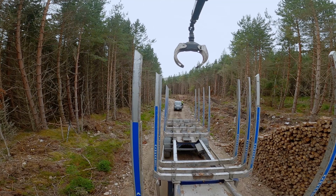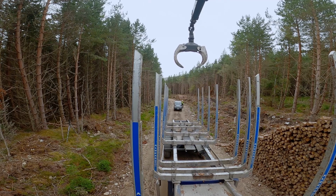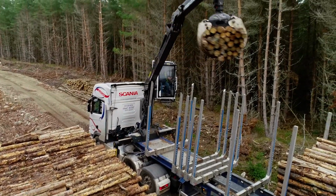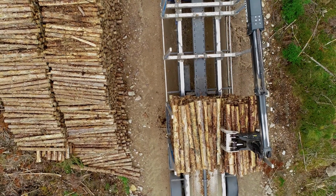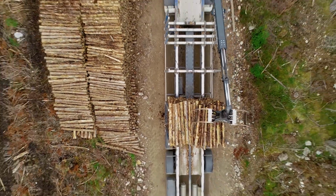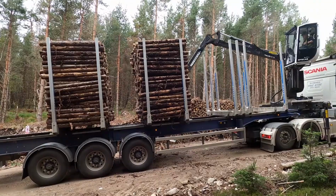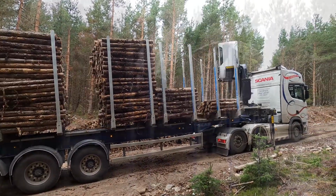Carefully set up the bolster or bunk arrangement on the truck trailer so that it is suitable for the log lengths that you are loading. Never set up to transverse load, i.e. timbers across the trailer, and give consideration to making the load easy to discharge at your end destination. Interlocking bays or bridging cargoes should be avoided where possible, but if this is unavoidable, all these bays should be adequately strapped. Always ensure that the crane you are working has been regularly inspected and has adequate LOLER certification.